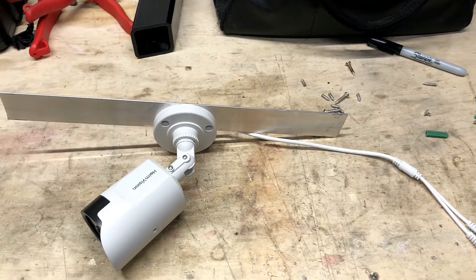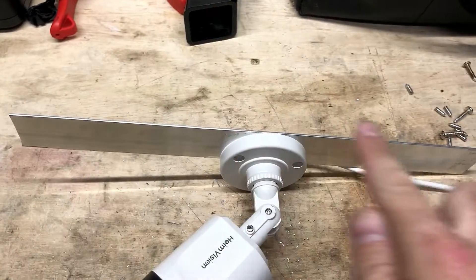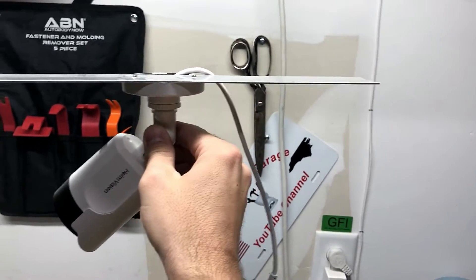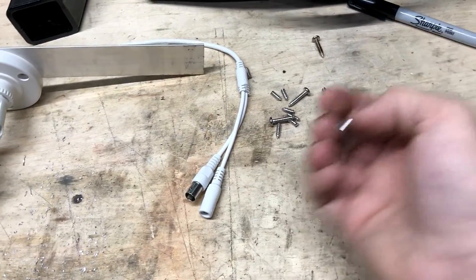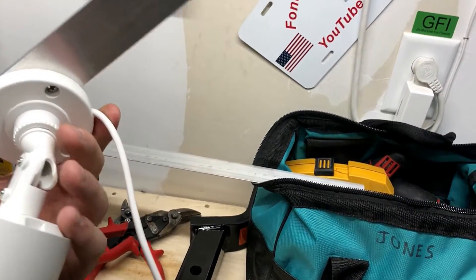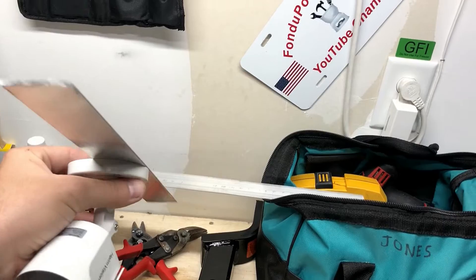Here's the bracket I'm going to be using to attach these to my house. All around my house I have a 15-inch soffit that has two metal L-shaped brackets on either side, and in the middle there is vinyl perforated soffit material. This will just be able to go up into the soffit — I can slightly rotate it and turn it into place. I may attach it with a couple of screws on either end up into the metal brackets. I just used two screws to attach this and I didn't use the screws they included — I found out real quick they didn't last very long. This is just real thin aluminum I got at my local hardware store, and I'll paint the exposed aluminum to match my soffit.